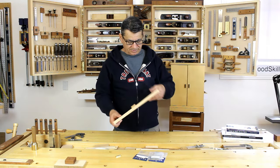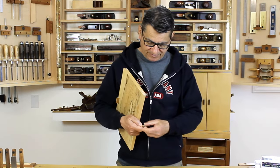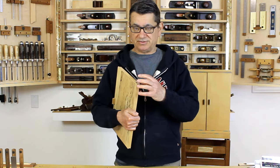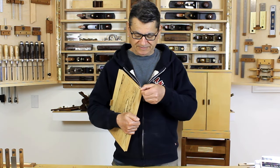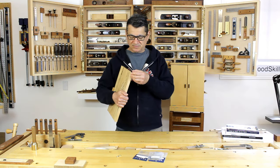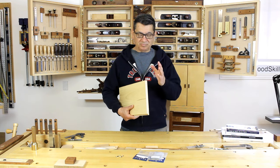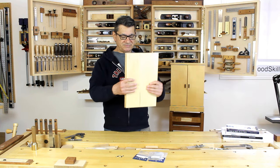Here's a separate door panel from another cabinet. This would be a leaf from a knife hinge, and this would actually slide into a mortise. The mortises, in my case, I create by hand — although you can use a router in that process. It's much quicker for me to create it by hand with a set of chisels and a good marking knife. You have to practice a little with knife hinges to develop a system. Marking is the most important component of installing knife hinges. The mortises need to be co-planar with each other — both the door and the bottom and top panels — so the door is not offset in any way.